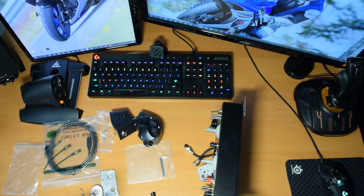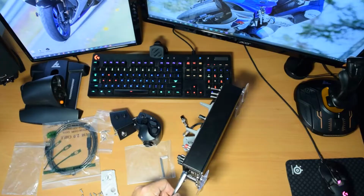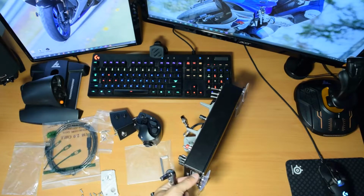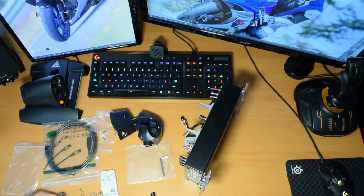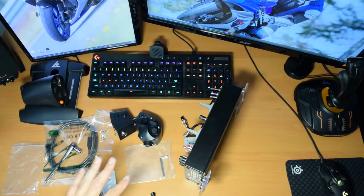And one thing I noticed is that if you did want to tighten these with a socket, there's no clearance. You'll have to get an extension to get in there with the clearance. It's also not a lot of space for fat fingers like mine to get in there. There's probably only a couple of millimeters of space between the nut and the wall of the base, so you would have to use an extension if you can't just finger tighten it. I'm finger tight right now, but I'm going to go get an extension and finish this correctly.